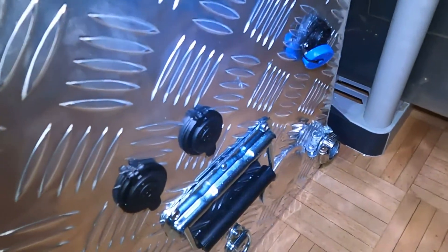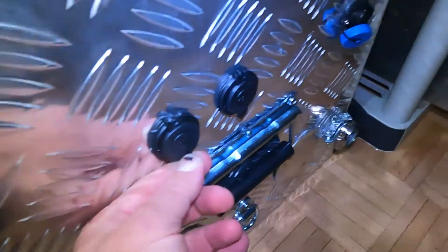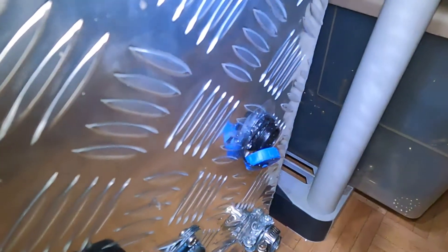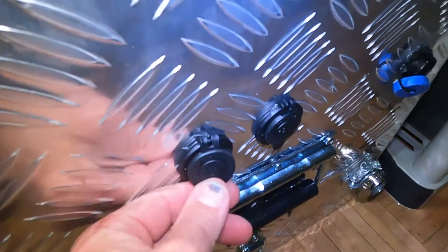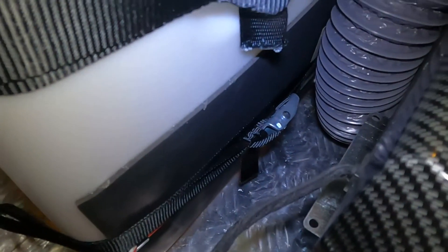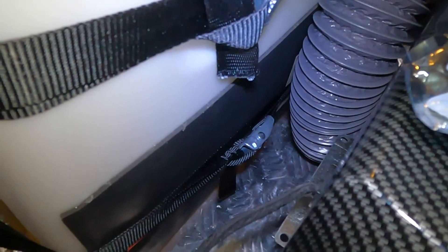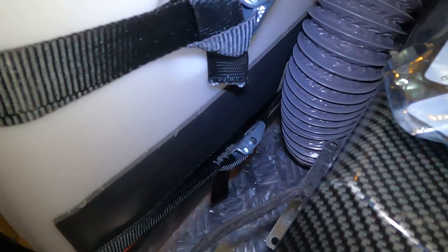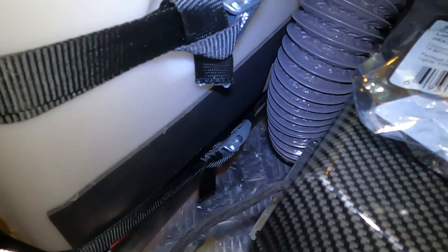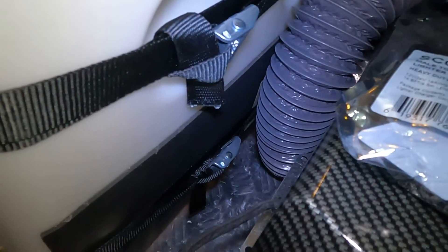The second modification I did is something similar but very easy. I had to solder these wires — I'm not a great solderer but it worked. This cigarette lighter right here is for a diesel heating pad. So if you see on my tank, this heating pad sticks to the tank and it turns on at 45 degrees and shuts off at 68 degrees. This way I don't have to worry about diesel freezing if I'm going to use this in very, very cold environments.